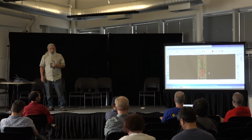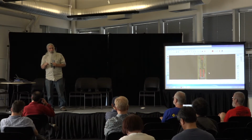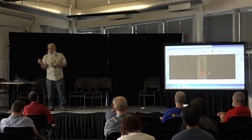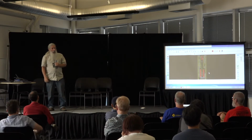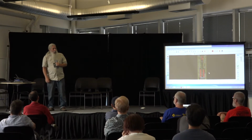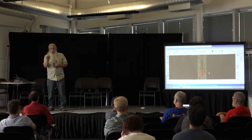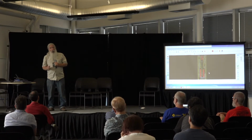The main thing about when you actually start KiCAD is you want to first check to see who the vendor is that's going to do your boards, because each vendor has different rules about minimal hole size and spacing of the leads. So I got pretty close to the limit for OSH Park here at 10 mil spacing. There's a setup that you do inside the KiCAD to actually put those values in. And it will automatically keep you from accidentally putting a trace too close. But if you take the default stuff, you'll find that it will be wrong.